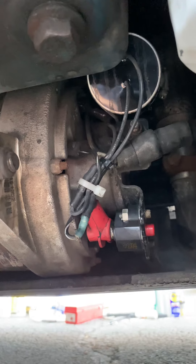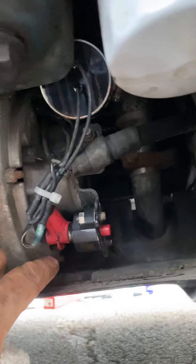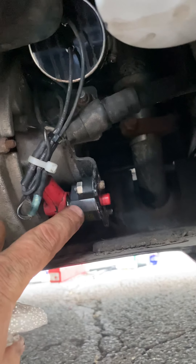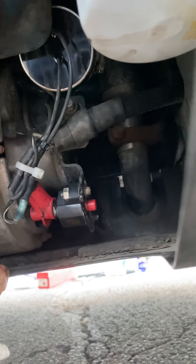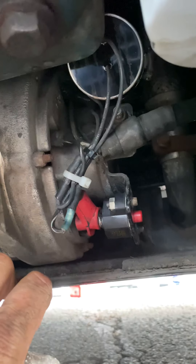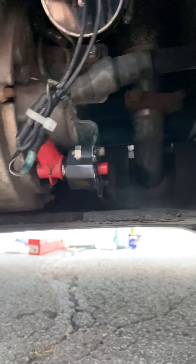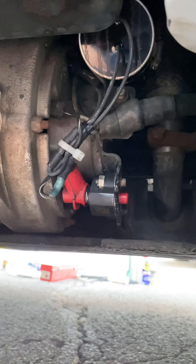So you know your trip is going to work — you're going to get AC and heat. But if it doesn't work and you check the circuit breaker and you got power on only one of those legs — one is missing — then the circuit breaker is bad. It's like a regular fuse: if the fuse blew up, you see the wiring inside is broken and cracked. So if you got no power, go to the circuit breaker, replace it, and after that when you replace it you get power inside — sleeper, heat, and AC.